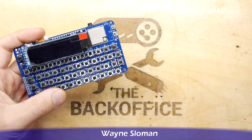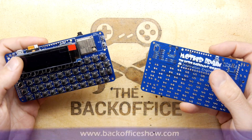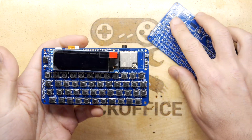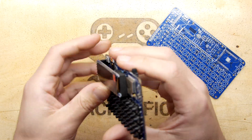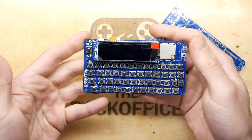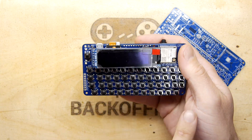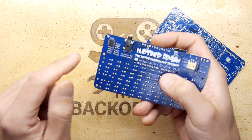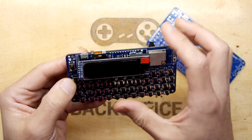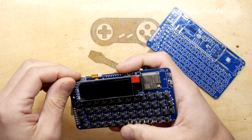The Inspiration Engine started off as a design because I absolutely love pocket computers. If you remember back in the 80s you used to have pocket computers by Casio and Radio Shack and all these different people - I never got one. The idea was I wanted something in my pocket that when I'm on the move I can tinker with. This is based on a dual-core ESP32 with Wi-Fi and BLE - not for audio but more for peripheral connectivity. It has an SD card interface and a 32-bit DAC with good sound output.